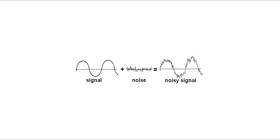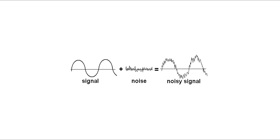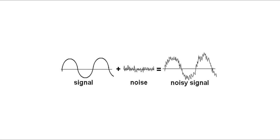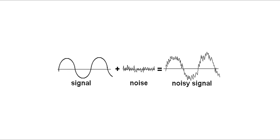This can happen when you route your cables directly over avionics or test equipment that generates a signal that can be absorbed into your cable and distort the signal you're trying to capture.